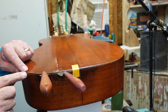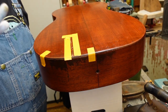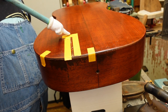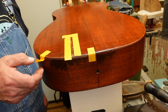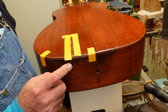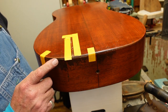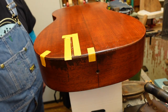This is my favorite palette knife because you can just go along and walk along like this. We're going to get this up to about here. I'll put another piece of tape there. Okay guys, I want to show you a couple of things here: I have put binding tape along the edge of the crack, left a gap there where it's raised up, ran one perpendicular to the grain — not parallel. I've used binding tape because when you put binding on a guitar, the tape is meant to hold the binding in place temporarily. I've seen people use duct tape and then wonder why the guitar is finished.